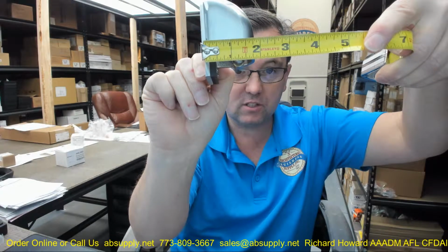The extended description information down below tells us the most important thing, I think, is that you've got a 3 3/4 inch clearance from the door to the wall, and that's going to be a combination of the projection of the body where the roller latch or the roller down there is going to engage the strike, and the back side of that is about 1 inch. The back side of the roller. So if we took the strike and went to where that roller is going to sit, it's about 2 3/4. So that's where your 3 3/4 comes in. Okay, if that makes sense. What I'm saying is the total distance between the outside of all of this is 3 3/4. Okay. Now back to the dimensional properties.